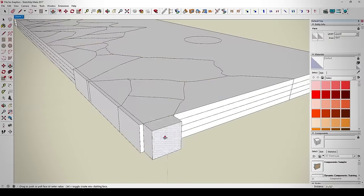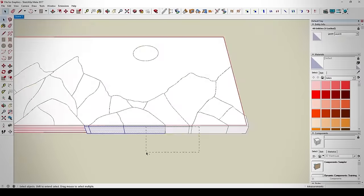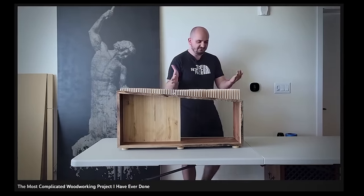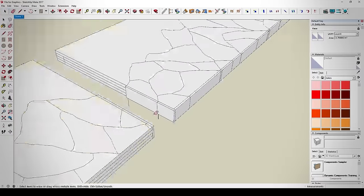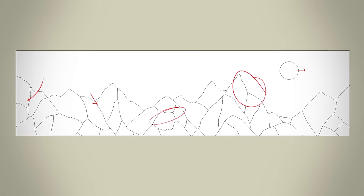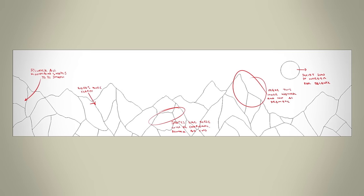With precision veneer cutting we can make stuff that would normally be a massive headache. I bought two different veneer types: white oak and walnut — I like that combo in wood. I decided that I want to make a mountainscape out of these two tables, so I used SketchUp to get a rough pattern and then diced up the mountains into smaller portions. I want to constantly change the orientation of the wood grain throughout them to really emphasize the geometry of the landscape.